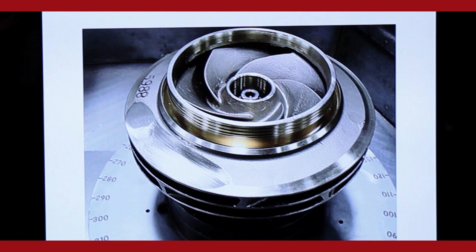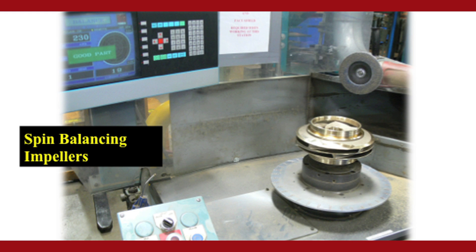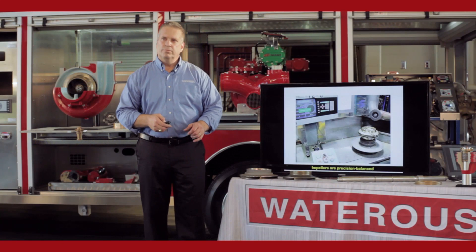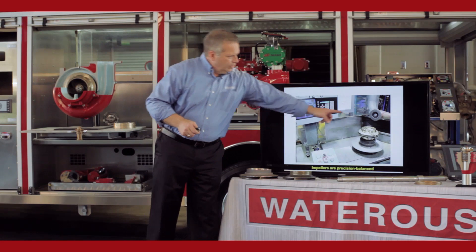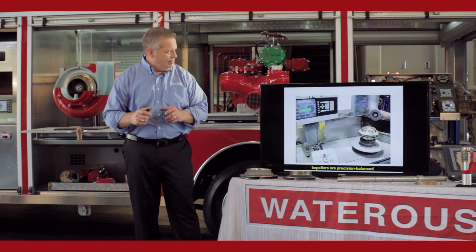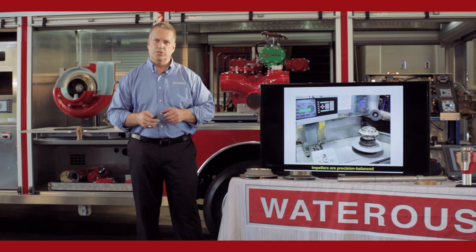As far as the impellers, before we ship them out or put them into a pump, they have to be balanced. We set the impeller on the machine — it's got graduation marks around the pedestal on the side of the impeller. It's going to spin, and the machine will tell us at that graduation point it's, say, 0.230 — so many ounces over. They'll take the impeller off the pedestal, grind it in a certain spot, put it back on the machine, and spin it again until it comes up and says it's a true part.